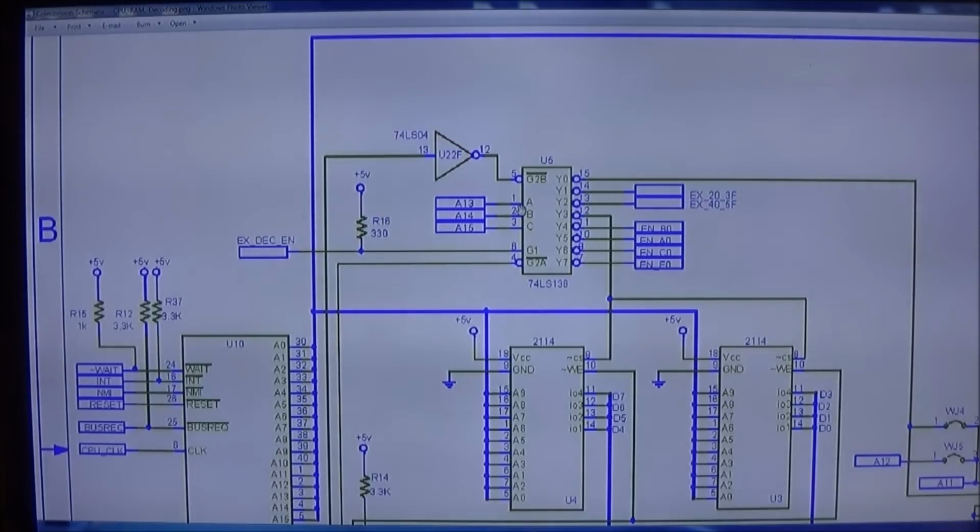So what I'll do is I'll hammer the RAM range with my Fluke, and I'll use the scope to watch and see if this thing's doing anything. I'll probe this right here, and I'll probe this right here. These two elements are what I'm going to be looking at. I'm going to make sure all of the enables are good. I know these will be toggling as long as the clock is good. And go from here with this stuff. So yeah, that's what we'll do.